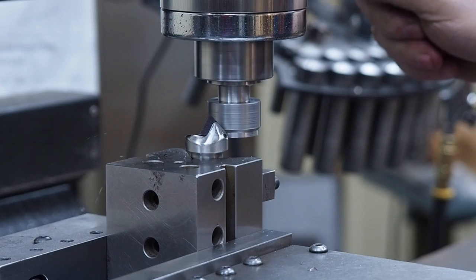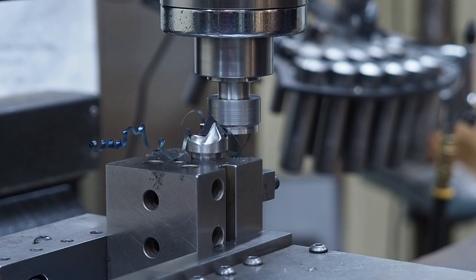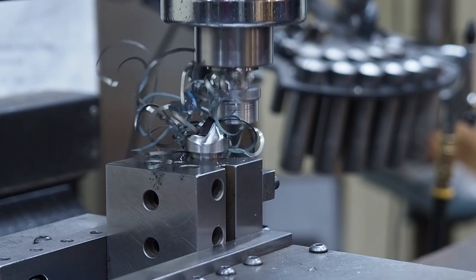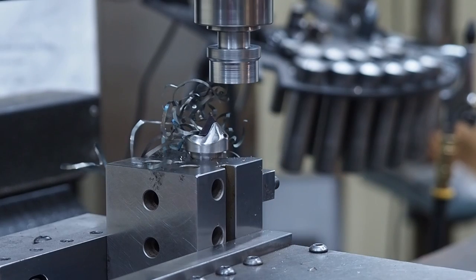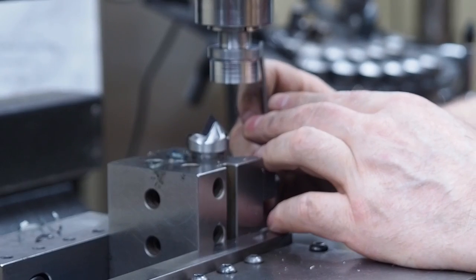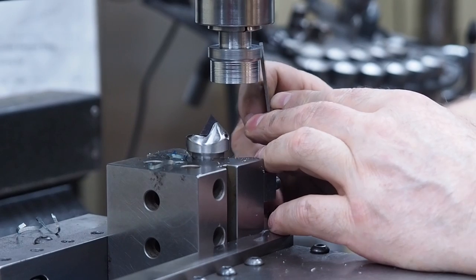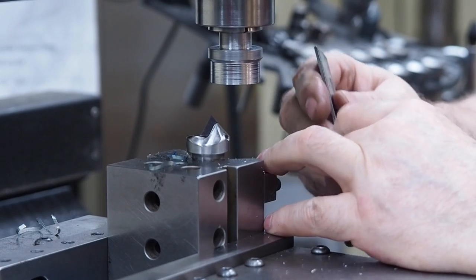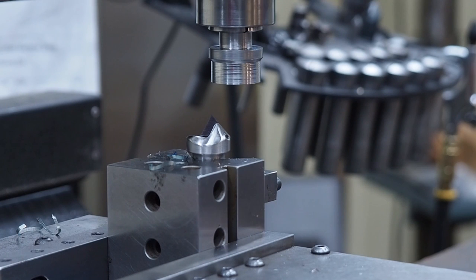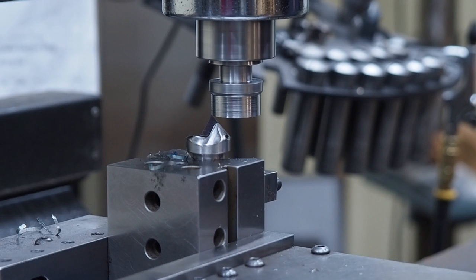You take little bites. Yeah, I'll just take and measure that. And again, this dimension is not really that critical. If I want to use this for a drill, I got on the print on the other one about a 5/16. This is about a 1/4 inch, and that'll work fine, and probably even a little better clearance if I'm going to use this for a drill. Always remember to hit that in reverse.